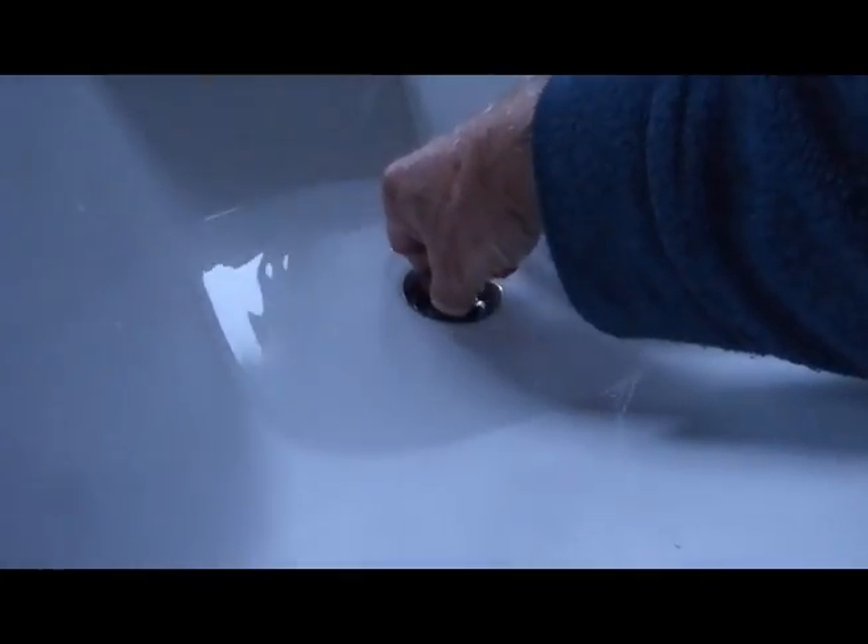In fact, that looks well blocked, I would say. The best thing to do with these is quite simple — with these pop-o-matics they tend to block at the very top here with hair and soap. So we'll take that straight out first; we'll soon tell because it will drop straight away.